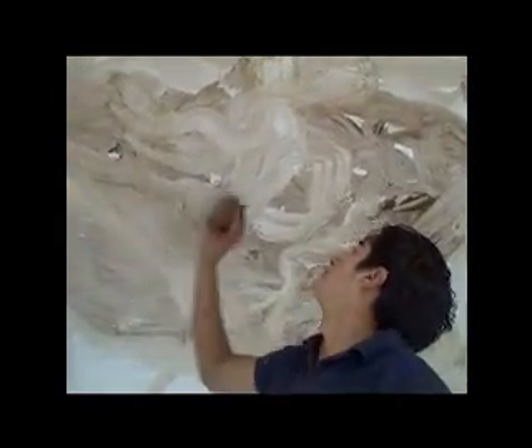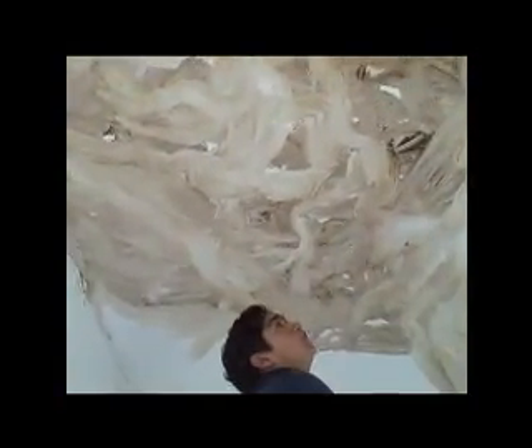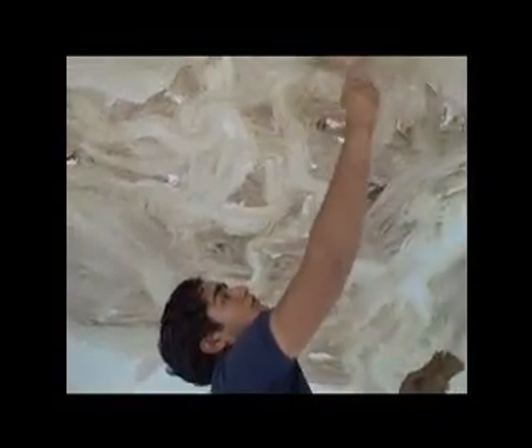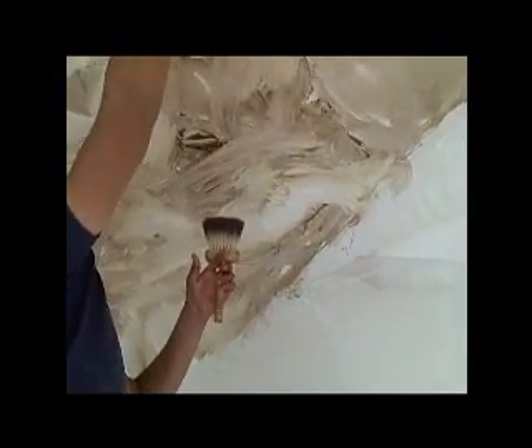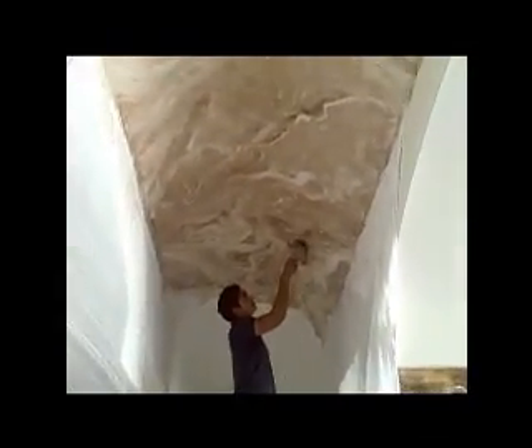He stopped and he started — he's moving it all around, that's what we do. This is probably Luis's fourth or fifth marbling job. We tend to overwork our marbles because we want the marbling to be soft and we don't want it to look fake. The way you avoid that is you keep it very natural by softening out everything and then coming back in and maybe putting some hard edges back in.